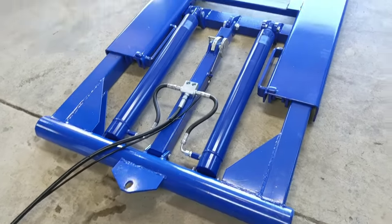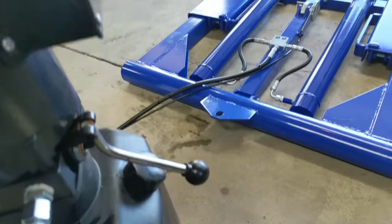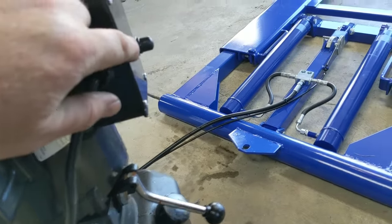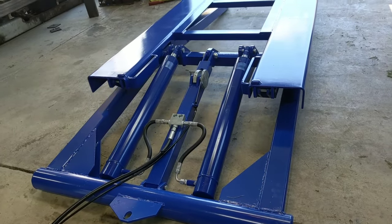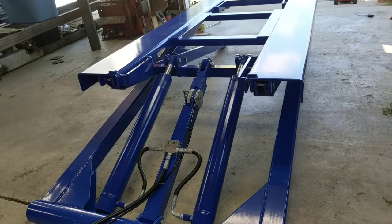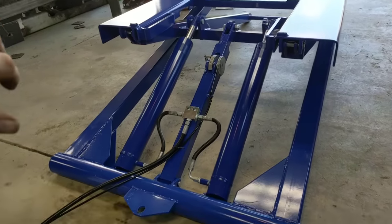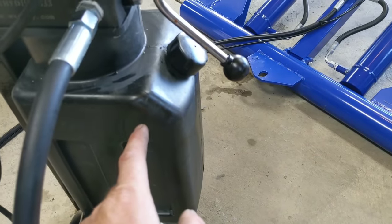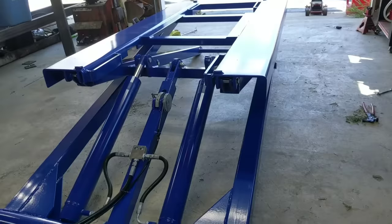I do know there's a problem but I want you guys to watch it and maybe you can hear what's going on. The way this works is there is a push button and a valve. The valve is a relief valve that lets it down; the push button turns it on and pumps it up. It's not very loud — everything is relatively smooth going. So far so good, and right there it's sucking air. My guess is there's probably some type of pickup tube that's supposed to go all the way to the bottom of this container and it's either bent, has a hole in it, or something and we're picking up air. When I lean this back I can actually get it to pick up more.